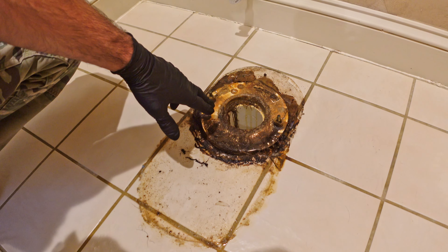This isn't necessary, but since I've already got the toilet out and this is easy to get to, I'm going to replace this fixed line here with a steel braided flexible line. So I'm just going to remove this — I've already loosened it up — take it off. It might drip a little water still in the line, so just have a towel there and put the new one on.